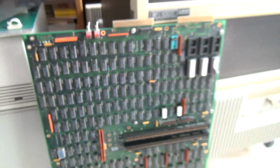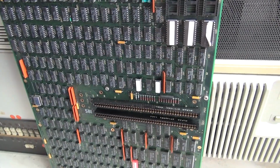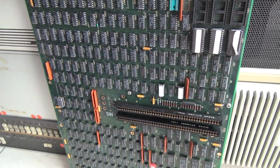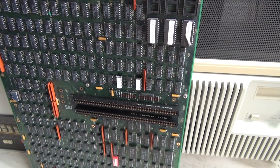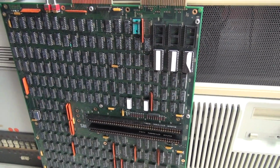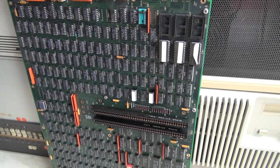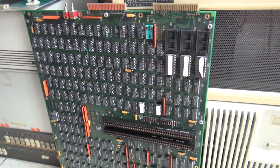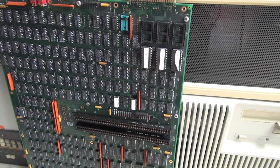So this is not a super old CPU, and it's quite remarkable that in 84 you would get a CPU that is still entirely made out of TTL ICs. But as I said, it's a very long-lived architecture. They did a lot of production runs because these things were used in critical infrastructures and in probably very expensive machinery, so there was presumably a demand for a long time. I don't know when they phased it out, but it was very long-lived. It doesn't look like it, but it's very feature rich.